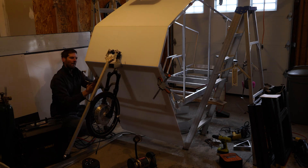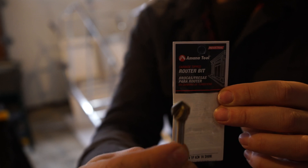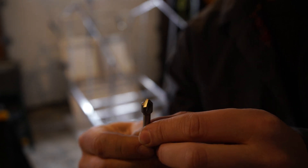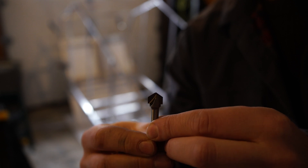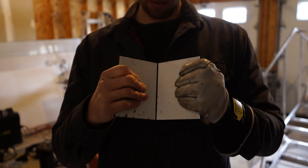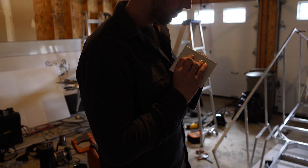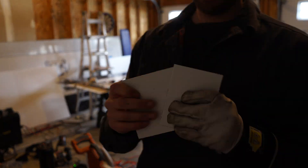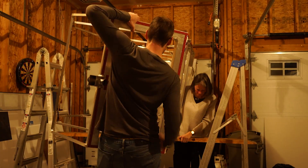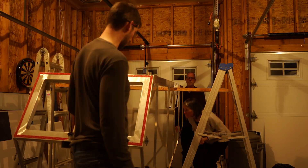If you're going to be working with ACM material and want to create folds without a clean break, I highly recommend getting the proper router bit. I bought a high-end V-groove bit from Home Depot — the difference with this bit is it has a flat nose, so it creates a three-millimeter flat channel at the bottom of the V-groove. That allows the material to bend more easily without flexing back on itself and snapping the thin aluminum. Testing showed it made for an order of magnitude stronger fold. The great part about taking over your parents' garage for the winter is you always have two helpers on hand — I got my parents to help me flip this over.